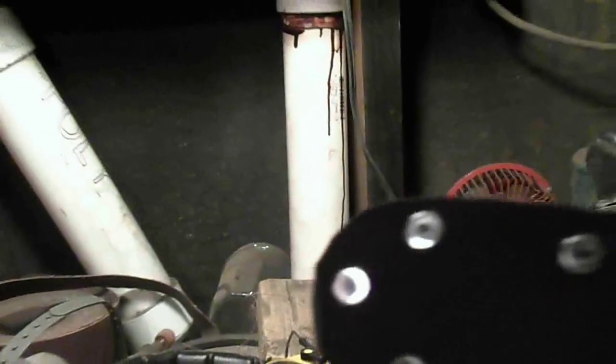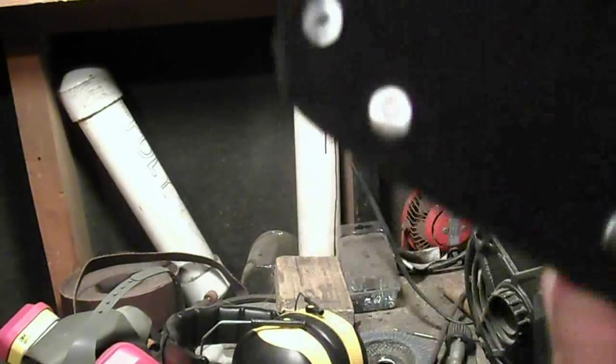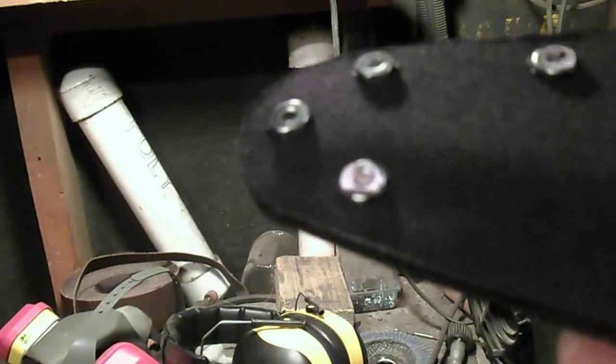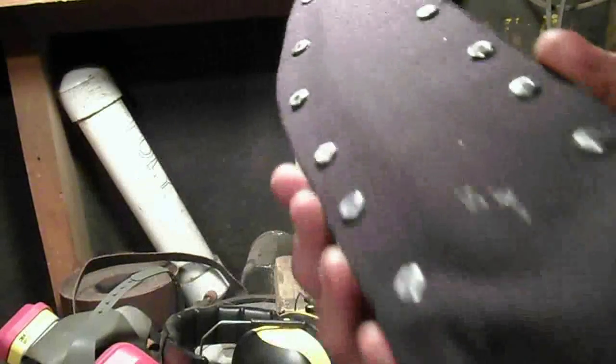That's all of them ground down, and as you can see, well, maybe as you might be able to see, I have no idea if you can actually see it. Each one is sunken in a little bit with some melted nylon gooped up around it, and I'm imagining that'll actually help keep everything pretty solidly in place so these nuts won't back off of the screws.